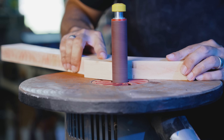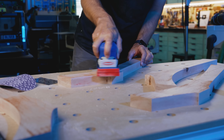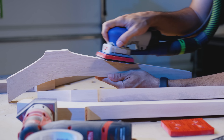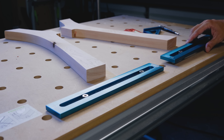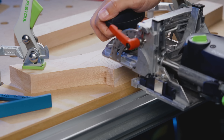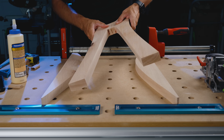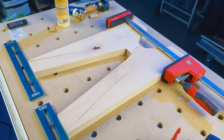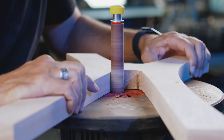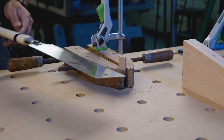Working out in the heat before I got the mini split installed eventually caught up with me. You see this rust on the top of my neglected sander? I didn't want to spend the time cleaning it up, which meant it stained the faces of the hickory — so the time I thought I'd save by being lazy was spent cleaning up the stains. To keep the base from rocking, I pinned and referenced both feet against MFT stops by TSO to keep the feet true and in plane with each other during glue-up. And to my surprise it not only worked, but I didn't mess it up.